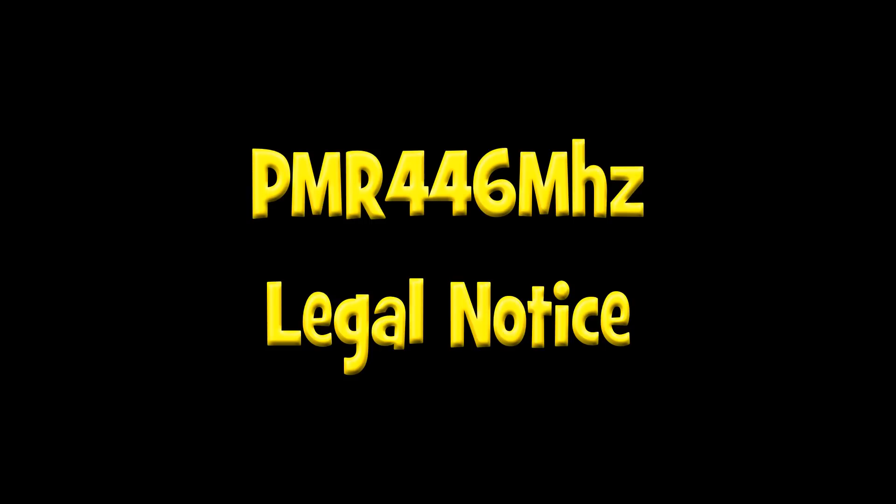On the subject of legality, here in the UK, if you want to stay entirely legal on the PMR446 band, you must have a regulated approved transceiver. The restrictions are that your radio should not transmit more than 0.5 watts — half a watt — and it must have a fixed antenna. These type of radios do not fit that criteria, so you are in fact breaking the law. In reality, you have to be pretty unlucky to be caught — I don't know anyone who's had radios confiscated or been prosecuted. If you're at a high-security function like the recent Royal Wedding, you might attract police attention. But I don't know of anyone who has had any trouble using these radios on the correct frequencies.